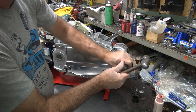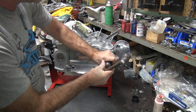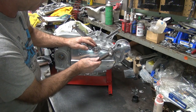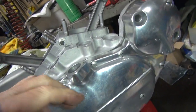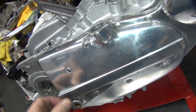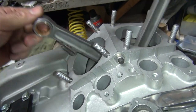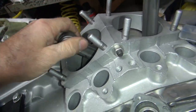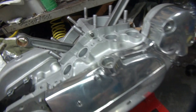Now these will have to be re-torqued after the bike's running. The screwdriver popped out and twisted on me just as I hit it. Still rotates around fairly well. It is definitely tighter a little bit — not sure why. But it's nice and even all the way around; it doesn't have a real tight spot in any one place. That's a plus. We're going to let that set up a little bit.